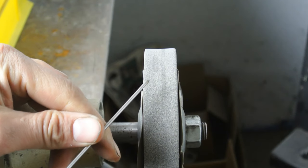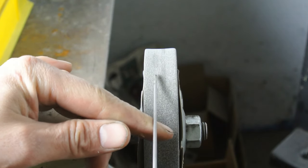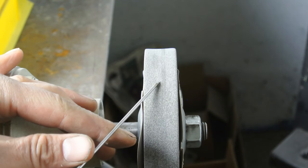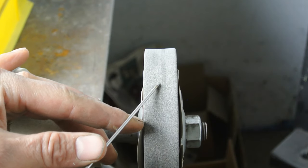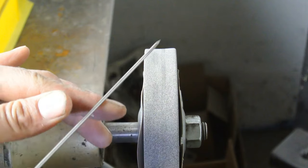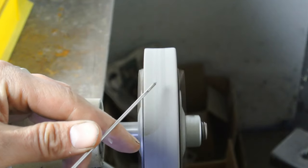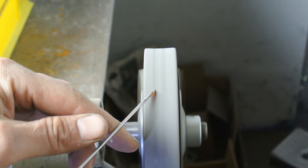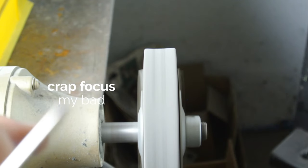It's really hard to get the lighting right in here to show you this, so hopefully you can kind of see what I'm trying to do. I'm not grinding my tungsten straight onto the wheel. I'm actually going to be at about a 15 to 25 degree angle, near the top of the wheel, supporting it in a cordless drill. Use that for the rotation, and I'm just going to use my finger to support the tungsten. Just clean it up, put a nice little angle on there, and there we go.